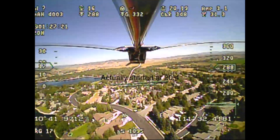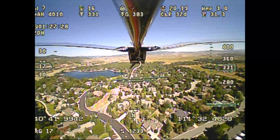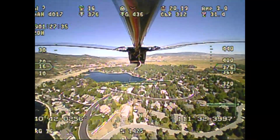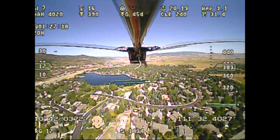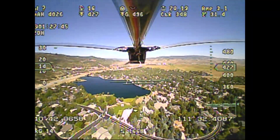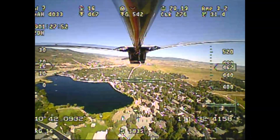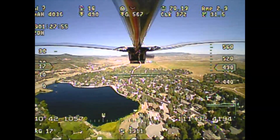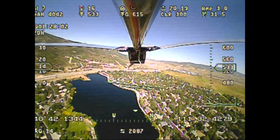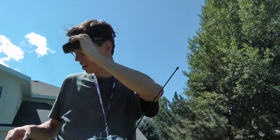Throttling up — we're at 3 amps and the battery is maintaining 20.25 volts, more or less where we started. It seems like the problem is that my motor pulls too much power from the solar cells, causing the solar voltage to drop and making them less efficient. But when the motor is off, the battery draws just enough that the solar cells operate more efficiently and can charge the battery quickly. So: motor on, solar cells give less; gliding, they charge up fast. It's now noon, so the sun should be pretty much directly overhead.